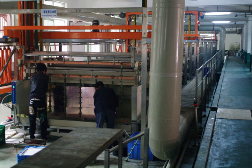The brush is moved continually to get an even distribution of the plating material. Brush electroplating has several advantages over tank plating, including portability, ability to plate items that cannot be tank plated — one application was the plating of portions of very large decorative support columns in a building restoration — low or no masking requirements, and comparatively low plating solution volume requirements. Disadvantages compared to tank plating can include greater operator involvement and inability to achieve as great a plate thickness.